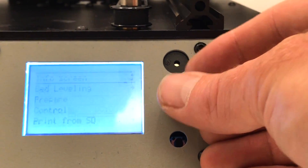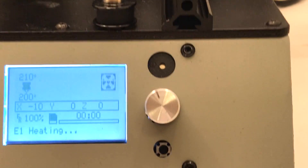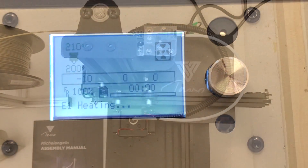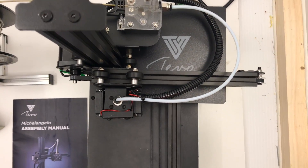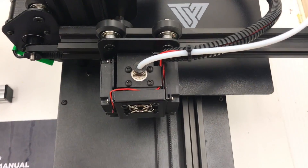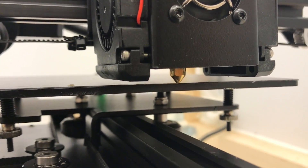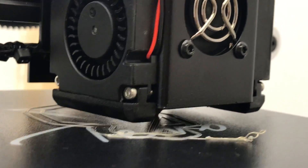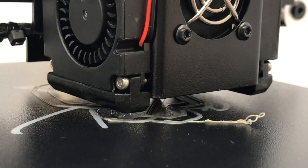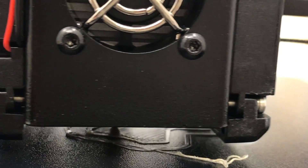Our next test for the Michelangelo is the Fox. I'm just going to select the G-code and press start. It's going to heat up the hot end — the nozzle, not the bed — because this printer does not have a heated bed, which in some cases makes it simpler for beginners. If you start out with something like this, you can always move up to a larger bed later. The Fox is a great test because it has a lot of different flat angles on all those different vertices.